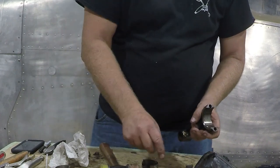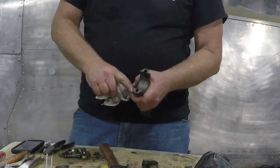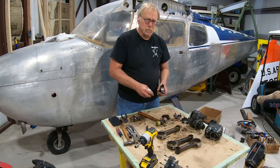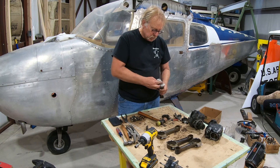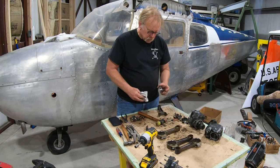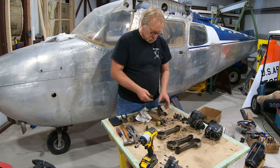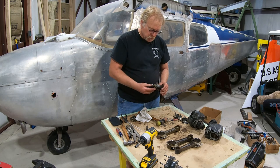And you can see here, all the bearings look pretty good. There's a little scratch mark on one of them. The other thing is, I'll hear people talk about, well, do you put oil underneath those bearings when you put them in? And the answer is yes, we do. And you can see here an engine that's running, all of these are just full of oil. So don't worry about putting oil on stuff. The manual says put them in wet. Put them in wet. And even after they're clamped and all that, you will still have oil migrating in there.